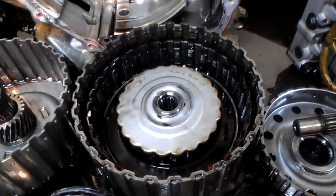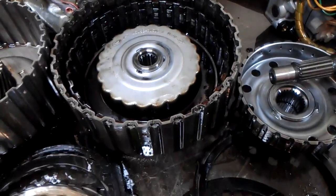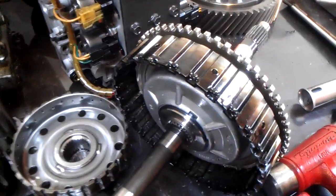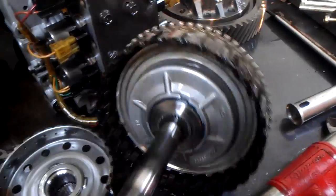This is the inside of the drum — looks a little discolored because it got so hot it actually turned itself black. The metal sometimes looks a little blue. This is the forward clutch drum, and we see the same thing here.